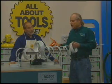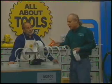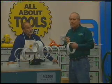The other advantages are they won't mark your material. You can use them on everything. A lot of people with spring clamps have problems with getting little burrs on them, and they pull them off and they're scratching their deck. So then you're increasing your fabrication time.